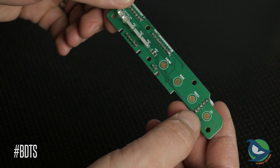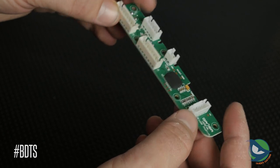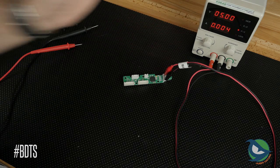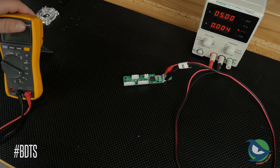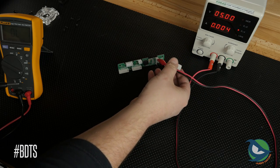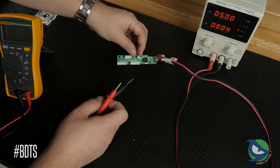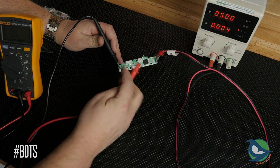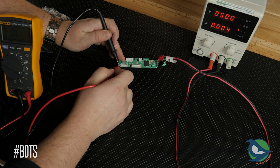On the bottom of the board, it's quite easy to tap into the 5V and ground lines coming from the USB cable, so you can add a secondary PCB or pad hack quite easily. Since this stick lends itself to modding better than the Drone, I wanted to see how the signals behaved when powered up and not synced with the system. I connected VCC and ground pins on the USB connector to a bench power supply and provided 5V. Using my multimeter, I tested the signal pins and found they were all left in a non-pressed state — i.e., they were high — so no diodes are required if adding a secondary PCB and you want to keep the stock one in place. Further checks show the PCB is common ground, making it even better and easier to mod.